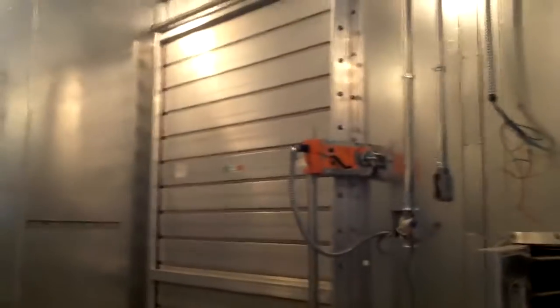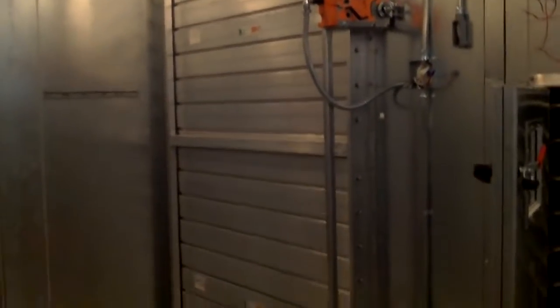On this area is the exhaust. All the exhausts from the building will flow out of these dampers. They have electric actuators on them that open and close when the building pressure warrants. The air is exhausted out these barometric dampers and they just flop in the wind based on the air pressure in this room.